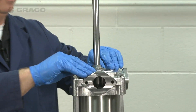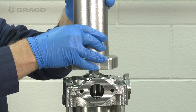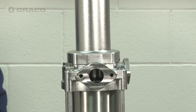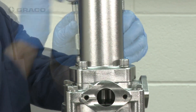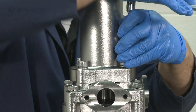Install the o-ring onto the upper fluid housing. Then install the bellows chamber over the piston rod and onto the housing. Make sure the lock washers are on the housing bolts and apply medium strength thread sealer onto the threads of the bolt. Install the four bolts, tighten them uniformly, and torque between 35 and 40 foot-pounds.